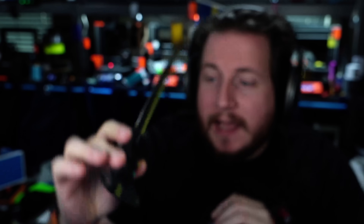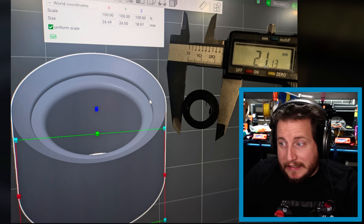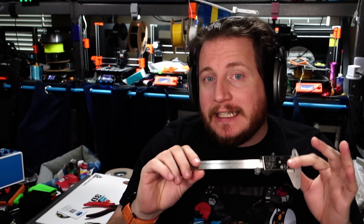On calipers — especially cheaper ones you can buy for under $20 on Amazon or from Harbor Freight — do not hit that zero button unless you're very certain you want it to go back to zero. These cheaper calipers don't hold tolerances or their actual values as well. At some point this one was either lost at zero or re-zeroed in a negative fashion. Moving calipers in and out rapidly is how you can get them to lose their position — that's likely what happened here.